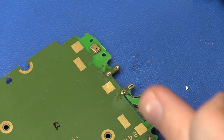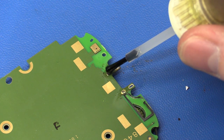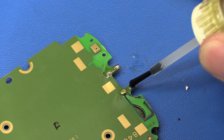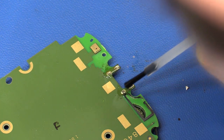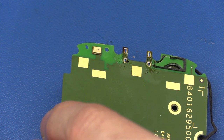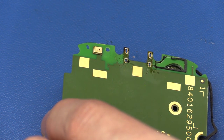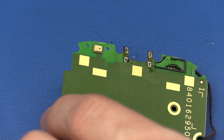And getting the last part of solder out can be a little difficult, but just regular flux, and plenty of it. And if it is really bad, some fresh solder on top will usually help pull the old stuff out of the hole.